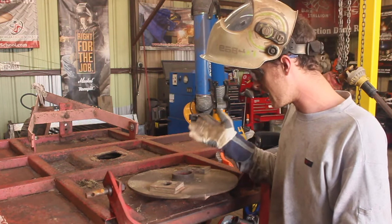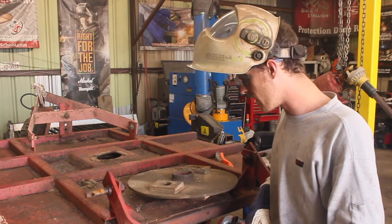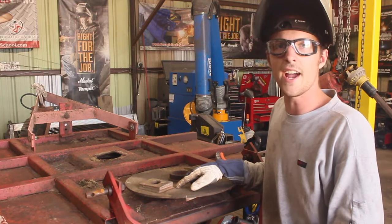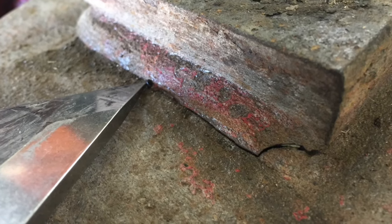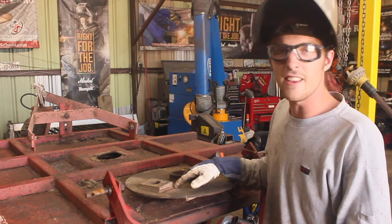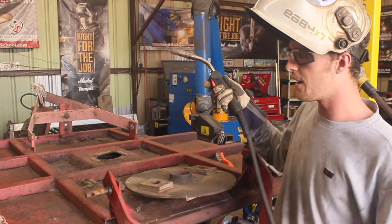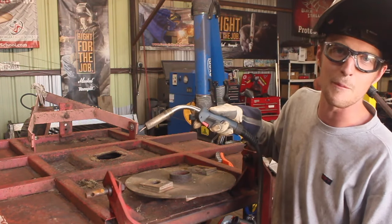This is the problem with MIG welding — probably short circuit, possibly spray. It's kind of hard to tell because this is so dirty and rusty, but basically we've got a big old cracked weld here that goes all the way around. It's made it halfway up this one side already, and this is a classic case of what happens when a guy welds too cold and it doesn't fuse into the bottom plate, and then the thing goes through years of vibration and shock loading and, surprise surprise, the weld starts to fail.